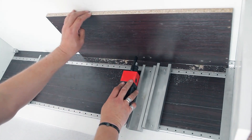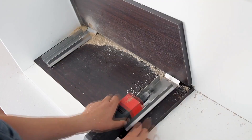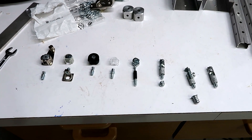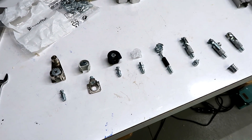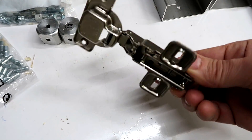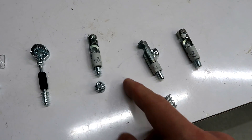The key thing to have is a big box to use all these parts in to help line things up, and the odd-shaped brackets are for lining up holes for Euro hinges. So it appears the target for this square drill and accessories is all about drilling holes to mount cabinet hardware fasteners which allow you to mount pieces of particle board at a right angle. Commercial cabinets are all about pieces of particle board attached together at right angles, and every one of these fasteners is for attaching panels at a right angle — including hinges, really; it's just that hinges allow the panel to open.